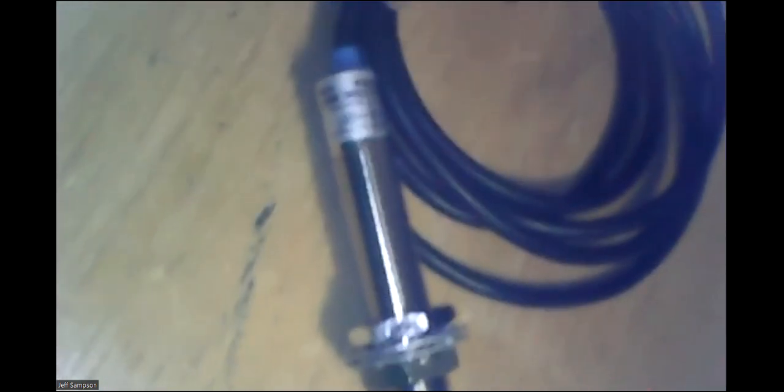And then also in that box, I keep saying every meeting, I hold up a sprocket on a wheel and say, if I had my proximity sensors. And here's one of the proximity sensors, and you can see it's got an LED on the back, and it's built the same way, where it's got the big threaded housing, and it's got nuts on there. So again, you drill a hole and you adjust it. So you can mount it so the plate's here, mount it so the plate's here, and it sticks out quite a ways. So anyway, these are the ones that you put power on, and then you get them close to ferrous metal, and they'll turn on. So you don't have to have a magnet anywhere; it can just detect stuff.